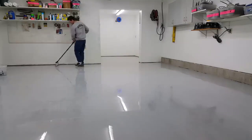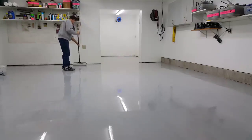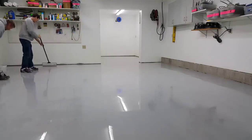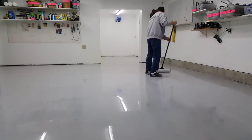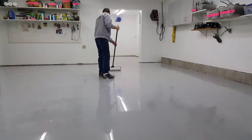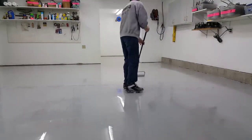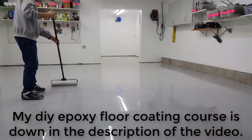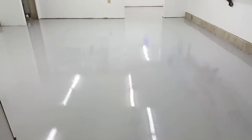Now we're putting the top coat on — this is a urethane top coat, a polyurethane. A lot of companies have a clear one and also a pigmented version where you can put down the same color top coat as the epoxy. We're putting down a light gray urethane top coat. The urethane is really hard, really scratch resistant, and it just protects the epoxy to give you a really good long-lasting floor. So that's the basics of how to do an epoxy concrete floor coating the right way. My course is down in the description — go check it out. This is what the floor looks like when you're done. Thanks for watching!